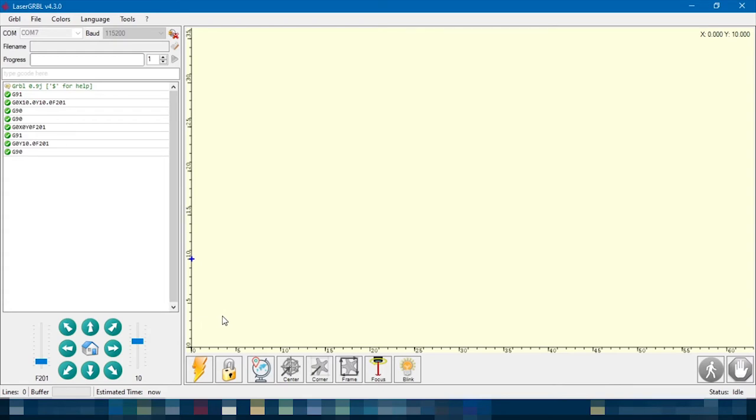And then you measure how far it's moved. So if it's moved 20 millimeters actually, then what you need to do is halve that value, halve the step value. So there are many commands you can do with this. X10, Y10 will move it to the point 10, 10.